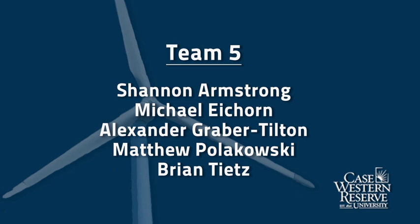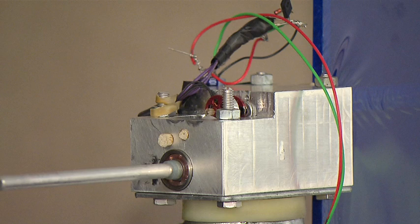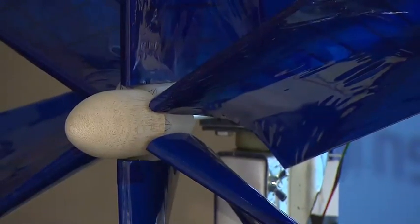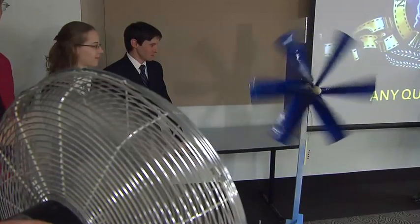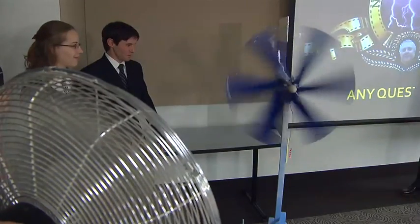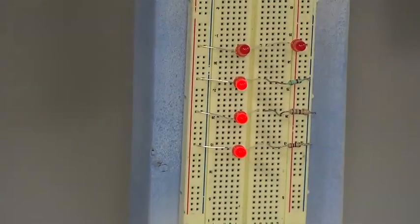We estimated the fan speed on the blades to be about 300 RPM, and for the generator the optimum speed is around 15,000 — so we needed a 50-to-1 ratio. We started with the main shaft coming off of the turbine blades. We also used skateboard bearings. The blades were constructed using techniques similar to model aircraft, with balsa ribs and monocoat covering, laser cut. Each little segment of the blade would be at approximately an eight-degree angle of attack, which would give a nice constant force along the blades. Through testing with just a resistive load and measuring the voltage, we were able to get about a watt and a half.